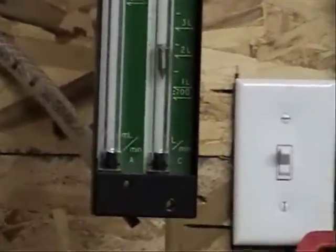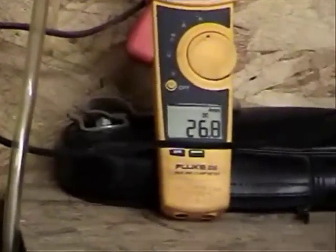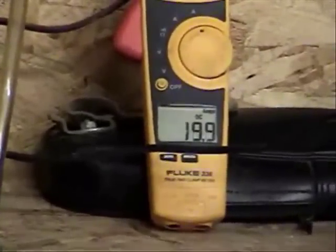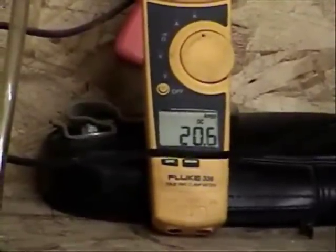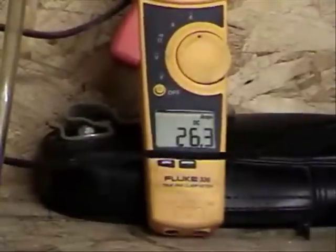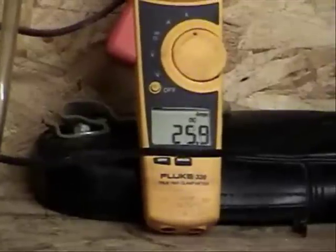You can see that we're doing a little over two liters per minute, and you can see that this is not a stable cell at all. The three hole cell is much more stable. This is due to the pumping action of the water not being able to get through the plates fast enough with only one hole top to bottom.